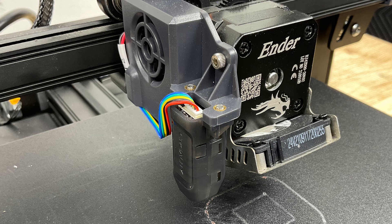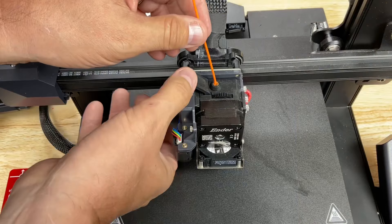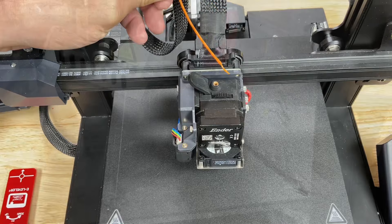The first step is to remove the filament from the hot end, so I'm going to use the preheat PLA from the menu to heat it up. Then I'll pull the release lever and push out a little filament and then pull up quickly to get everything out of the nozzle. While it's still hot I'll use a brush and clean any residue off the bottom of the nozzle.